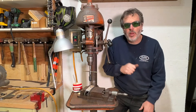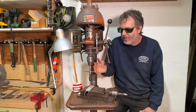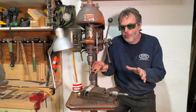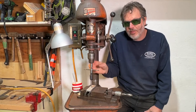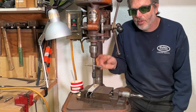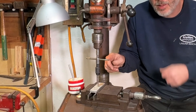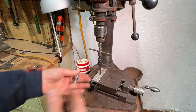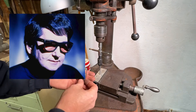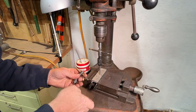Method number two — I'm over here at the Walker-Turner drill press. The drill press is a great tool for tapping; it keeps everything in perfect alignment. Best case scenario is that you use the drill bit to drill the hole, like a number seven, then take that drill bit out. While everything is in perfect alignment, you put in a tap follower and your tap wrench with the tap, and then tap the hole. Here's the setup: I've got the tap follower, the tap wrench, and the tap.